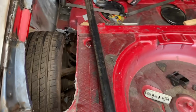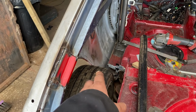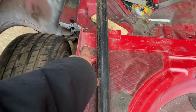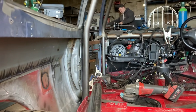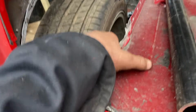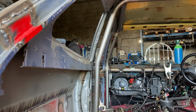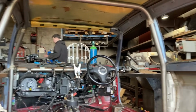This is where we've got the issue. Obviously, if we were to bring the bar down here and bring it onto the arch, there's absolutely no strength in the arches that we're going to put there. Now, there's a strength point there where the spring is too, that's solid, but the angle for that is going to be steep and it's going to look horrible. So we might have to bring it back to this, where the rear shocker comes up, because that's a solid mount there, and have a long one there coming along, and then a massive cross in it, and then some little bits for the harnesses to go into.